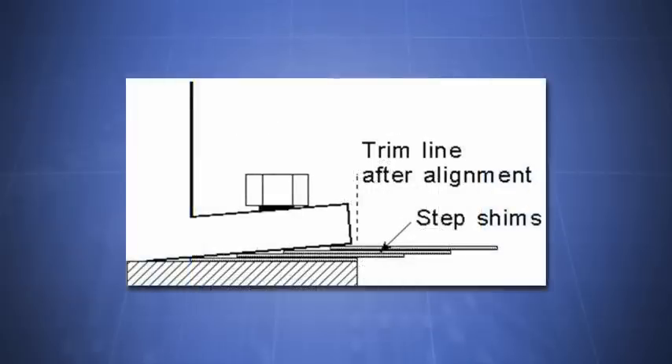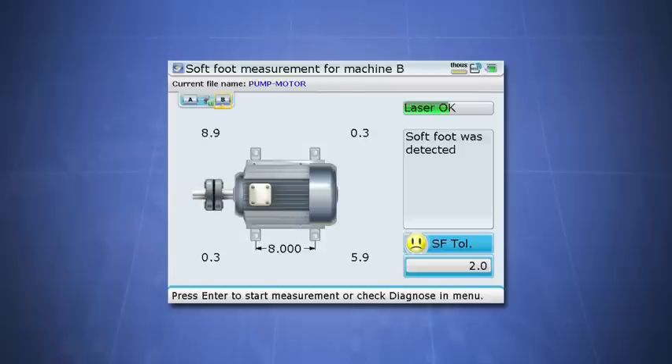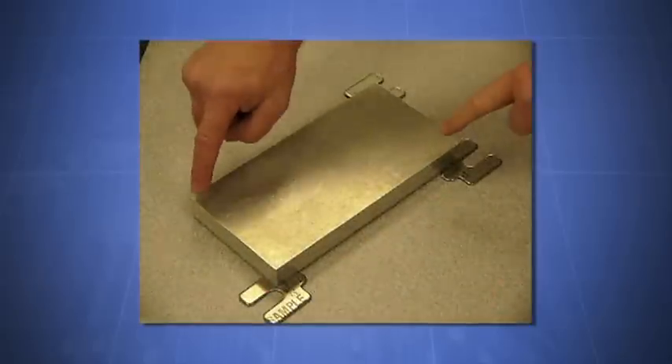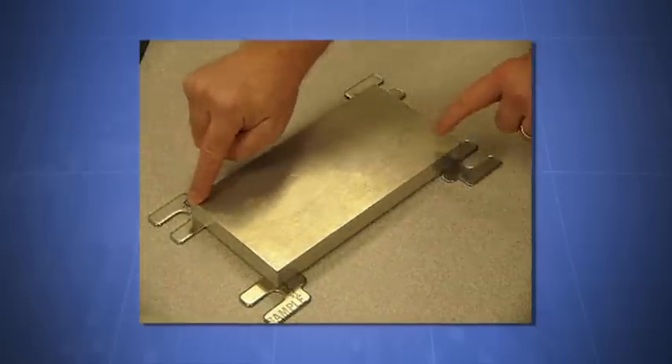While most gaps under a foot can be filled with pre-cut shims, a foot that is angled or bent requires a step shim to fill in the gaps. Let's do an example softfoot measurement on this motor. All four feet are measured for softfoot. The numbers indicate that the values on the opposite corners are higher than two mils, indicating that these two feet are causing a softfoot. One foot is loosened and a feeler gauge measures the exact gap under the four corners of the foot. These values are recorded, the foot is retightened, and the opposite foot is inspected in the same manner. The feeler gauge readings show that the feet have more gap in the outer corners — this is an example of a rocking softfoot. What is actually happening is that the machine rocks to the side to create a gap when the feet are tightened. The solution is to simply shim one foot to get rid of the gap.